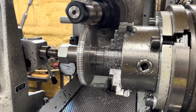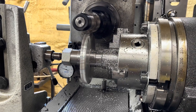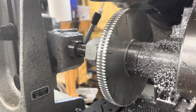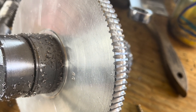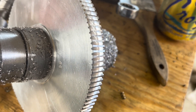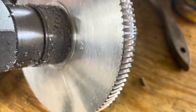I could probably do this a little faster but it took me a couple of days to get this set up, so I'm going to make it last. Starting to look more like a gear. It came out pretty good - the teeth are pretty small compared to what I'm used to, but it's Mod 1, 120 teeth. I made this out of an old aluminum 80-tooth gear that was excess to need.